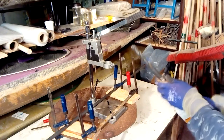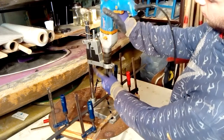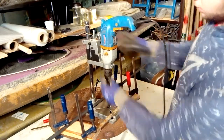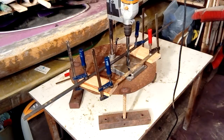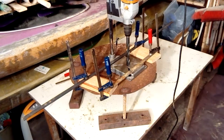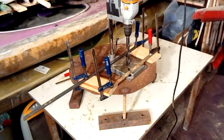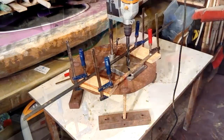I have my 18mm drill bit in my hand drill. Now I'm gonna attach it to my drill press jig. I added these weights here to add a bit more stability. I have my safety goggles and earmuffs on, and I'm gonna run my drill on the slowest speed.